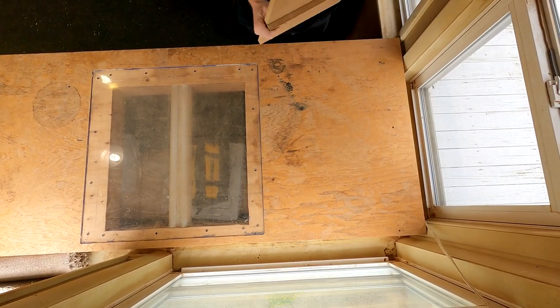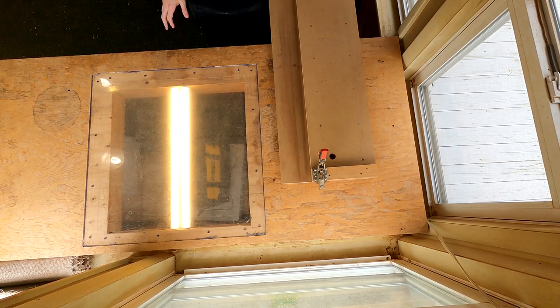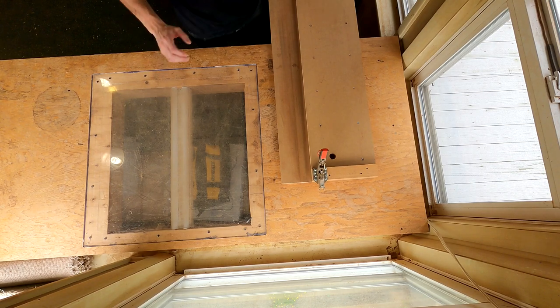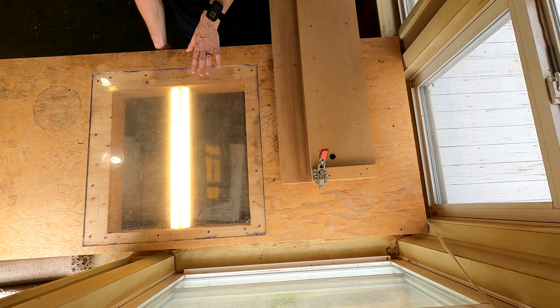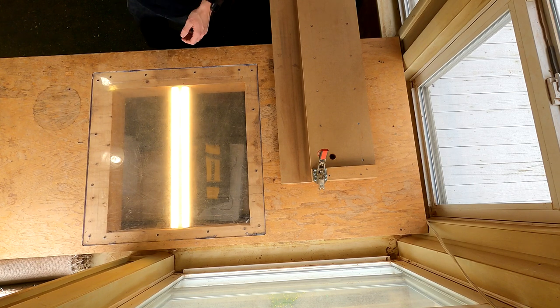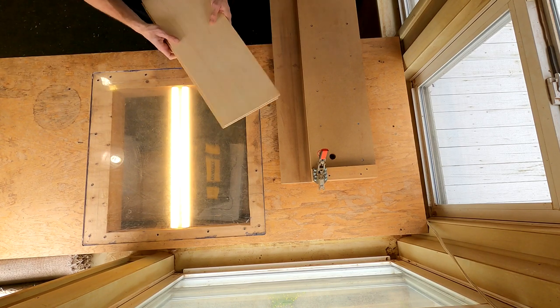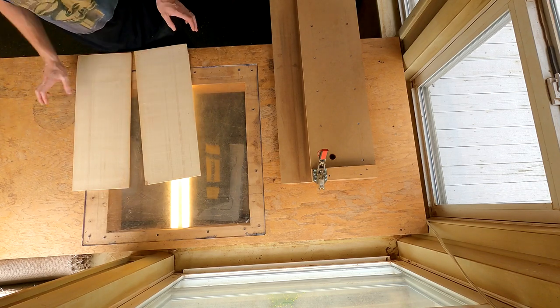Let's pull out the shooting board. There it is. We're going to turn on the light box — actually I won't need it right away, so I'll keep it off for now. But I just wanted to show you that I have it activated on a switch right here, very convenient. We're going to use this to candlelight the two pairs — the seams at the bookmatched pair. So let's pull out our first set and just go straight down the line. I'll start with the German spruce tops.